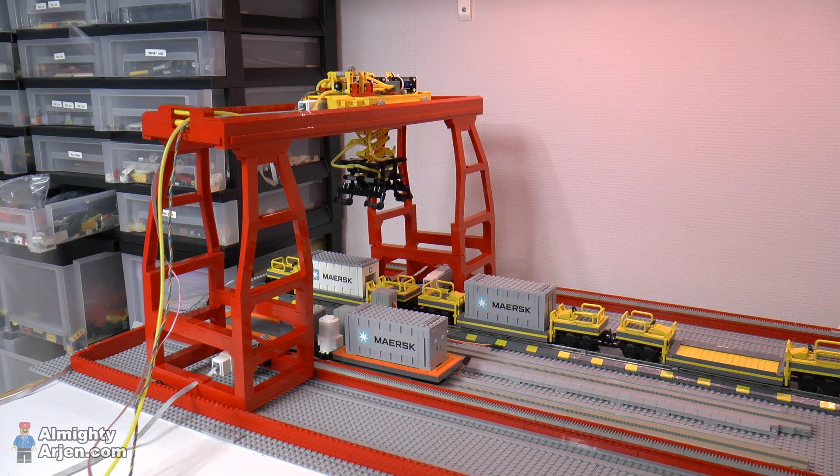So how to fix this problem? There are two possible causes. The first is that the motors don't run at the same speed, but that's unlikely since they're the same motors — they were replaced and the problem remained, so that's ruled out. Another possibility is that the left support has more friction than the right support, which would also result in a lower motor speed. That's the problem: we need to fix the friction.